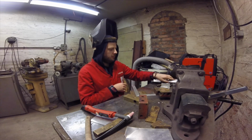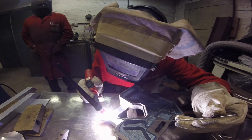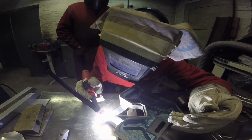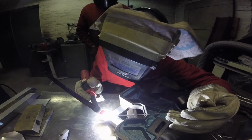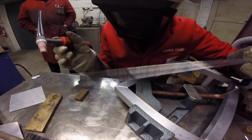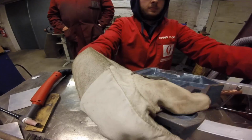Anyway, onto that welding. Now here I am using a nifty little vise which holds the outer pieces of the board in line and together and acts as a heatsink. So once you've lined them up correctly, all you do is the one edge, and then it's just a case of flipping it over and repeating it until you've done 8 welds, and you've kind of got a frame assembled. And there I am. That's the final weld out of this process.